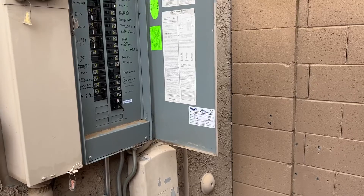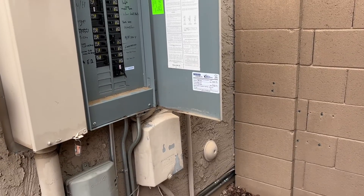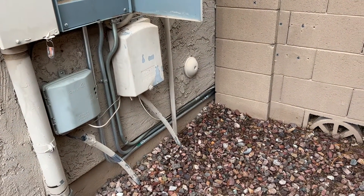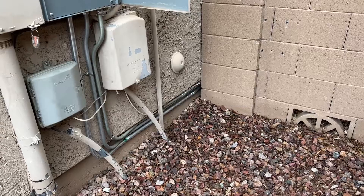Because I was doing this pretty complex home install, I was really looking to get the best charging speed that I could reasonably get and that most vehicles support right now. So that means getting a 60 amp breaker. From that 60 amp breaker, you're able to get a just-under 12 kilowatt, 48 amp charging speed on that 60 amp circuit. These are the specs you'd be looking for to make sure your car can support them.